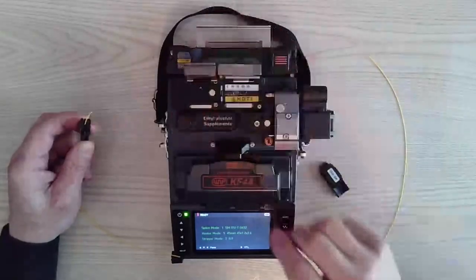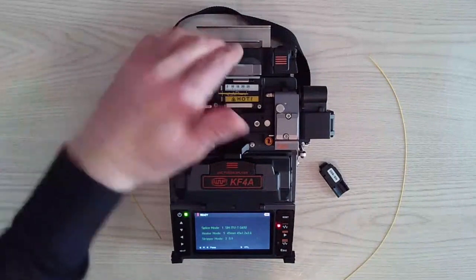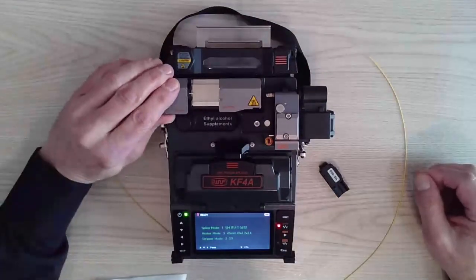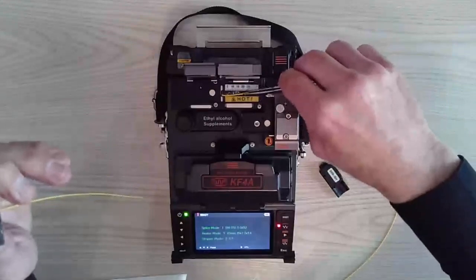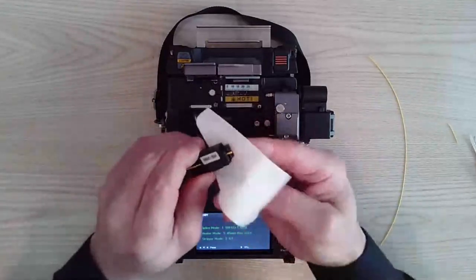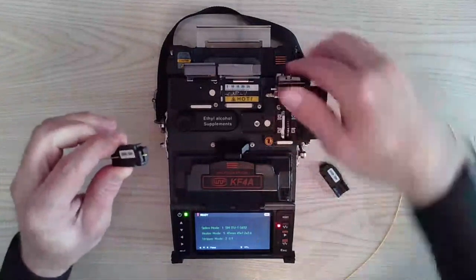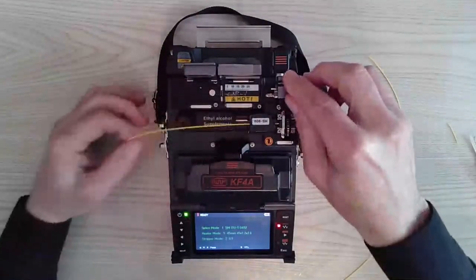So once I turn that on, I can place it into the thermal stripper. I close those doors. 2 seconds later, the magic happens. I open one side, take that out. Open up the other side. I'll take that off the hot plate. I'll take our alcohol that's on the machine with our lint-free cloth, clean that off, place it into the cleaver. We also have a trash bin that will collect the shards, so no more shards on the table.